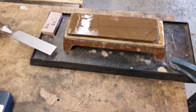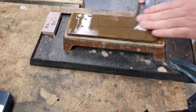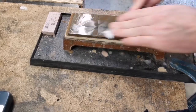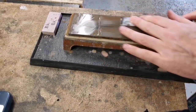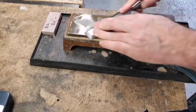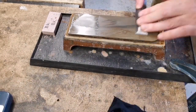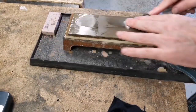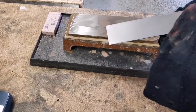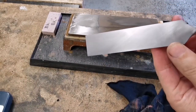Right, next stone. This is my not-very-happy 6000 grit stone, but it was quite expensive and it was lapped after the last time I used it, so I don't need to do anything to it. I'm just going to give it a couple of minutes on here because this is a good, beautiful stone. It is quite flat even though it looks a bit bumpy. And the dull silver is going — it's starting to shine a little bit more, beginning to see some reflection.